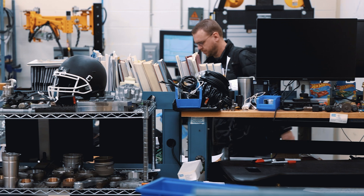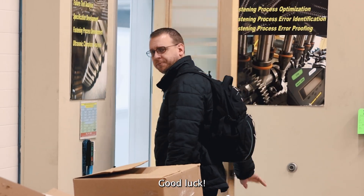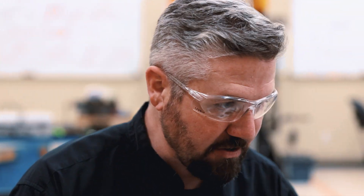Hey Mike, what do you think is going to happen on this one? We've got the super long extension and the swivel at the end offset at about a 30-degree angle. You might be wondering how we're going to measure the torque here — I can measure the torque at the tool, but I'll measure the torque that it puts into the joint with a digital torque wrench by checking the residual torque. So hopefully this socket stays on here. Don't try this at home.